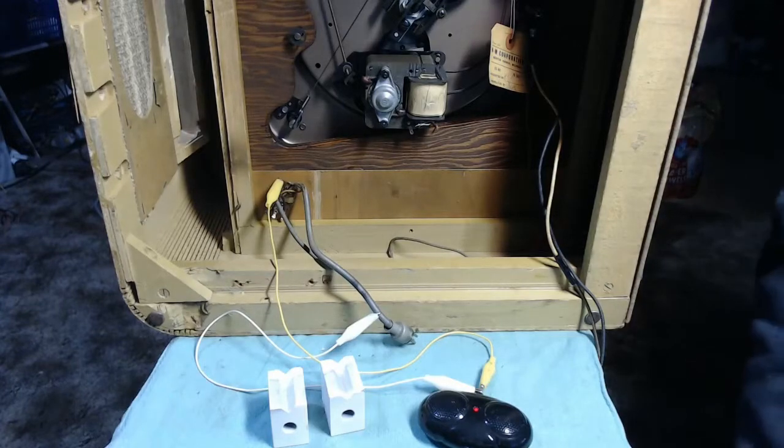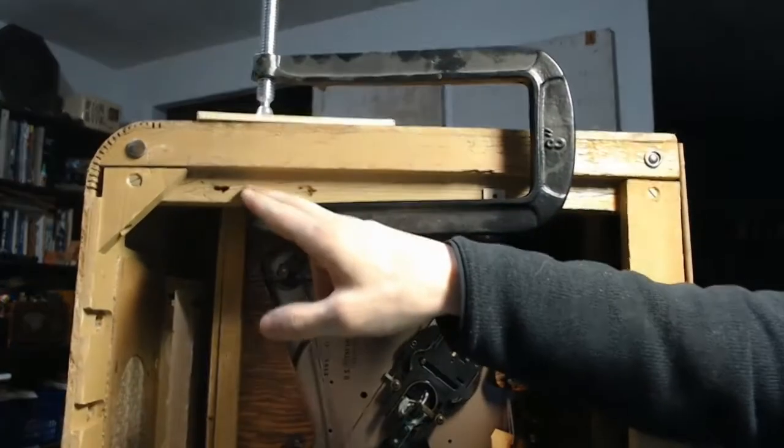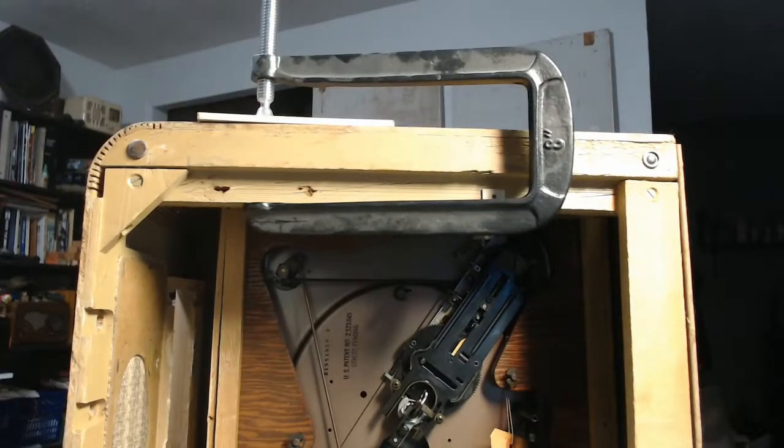If we tilt the camera up here, I'm dealing with some of the crack issues where the radio mounts back inside, so I filled those full of Titebond. We're clamping that, trying to get those to seal back up, and then I need to go to the hardware store and pick up some new mounting screws because the heads on the originals are really wrecked, and I need something a little better to get them in and out again. Also, I need to repaint the back of the dial scale because the original red paint is all screwed up from whatever junk got behind it.